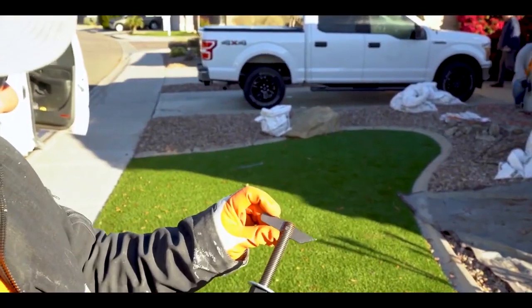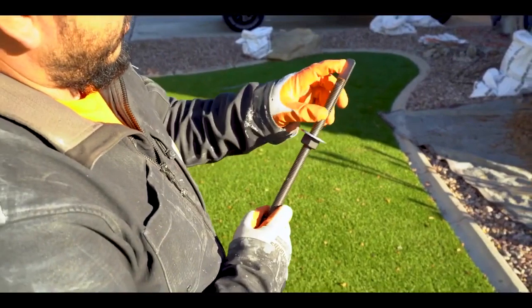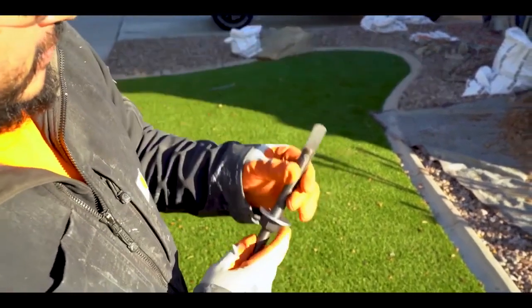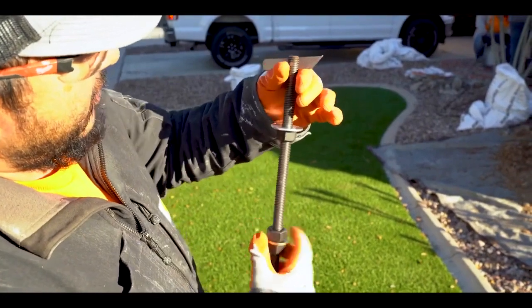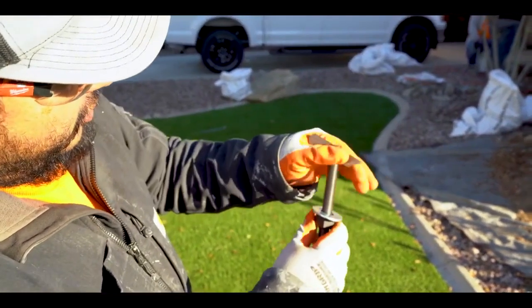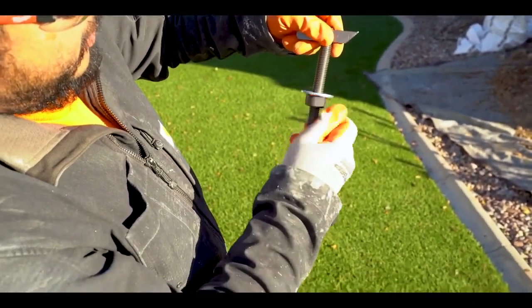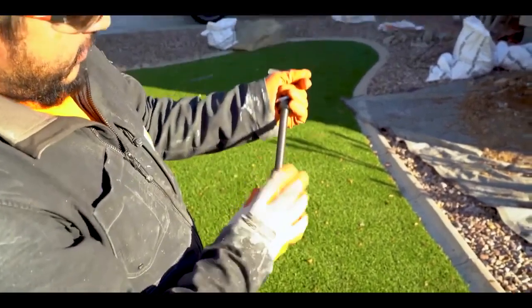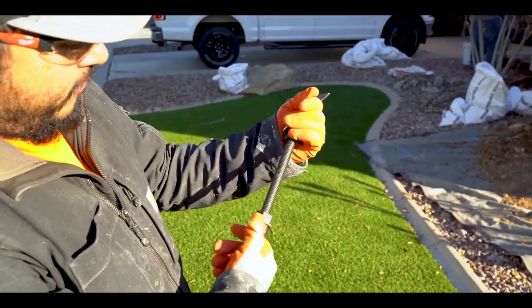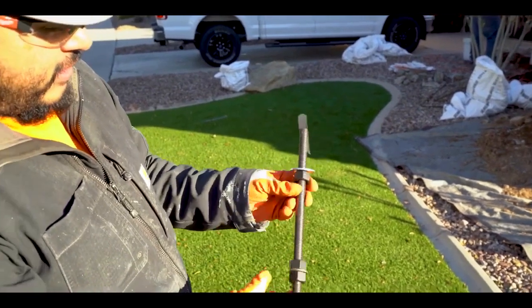This is our anchor bolt — it has this little teeter on it. The idea is to insert it back into the hole where the previous j-bolt was. It goes in and you shake it around a little bit, and this teeter comes up. Rather than the old repair where you put a washer and nut on top from the inside, you screw it in from the bottom and tie it from down here. This braces it after the old one fails, and it pretty much acts like a toggle. The current existing j-bolts need all-thread so you can cut it to size.